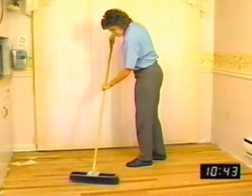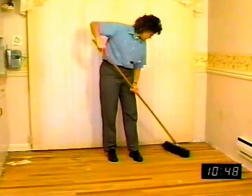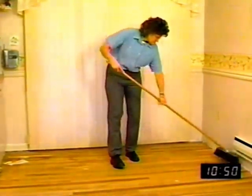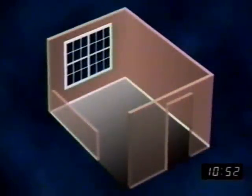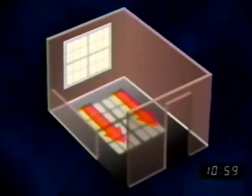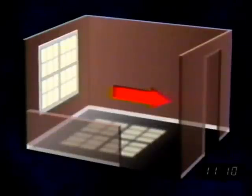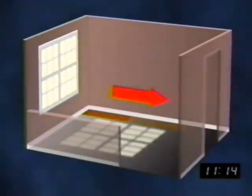After you've cleaned up any dirt and debris, you are ready to begin the installation. The next step is to begin the layout of the floor. To decide where to begin, consider incoming light. It is usually best to install Armstrong Swift-Lock laminate flooring with the planks running parallel to light coming in windows or glass doors. For any installation, the starting wall should be long and as straight as possible. So find the longest, straightest wall parallel to the incoming light — that's where you'll begin.